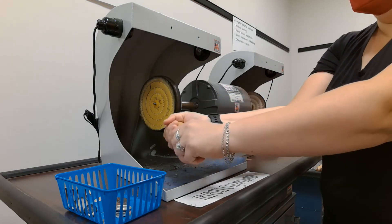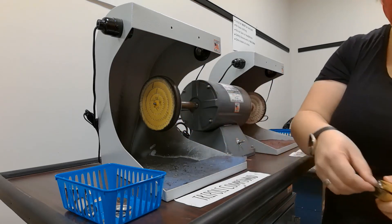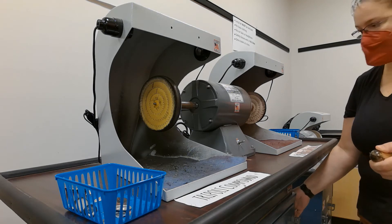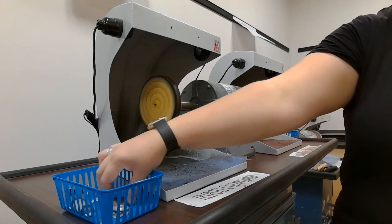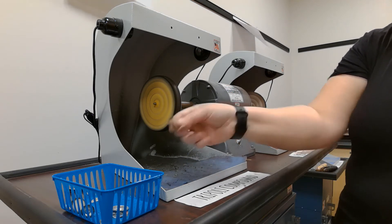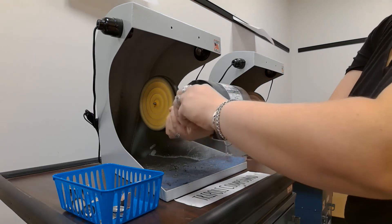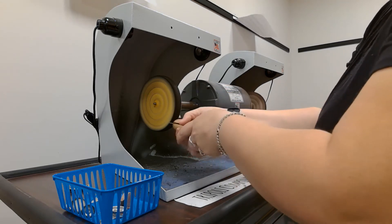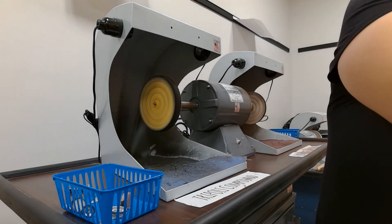Keep your hands here and you have to kind of move the piece around a little bit. Flip it, move it around, then rotate it to get to the other side. Safety glasses on, wheel on, compound applied, two hands — I'm going to be on this side. You can see it's getting nice and shiny.